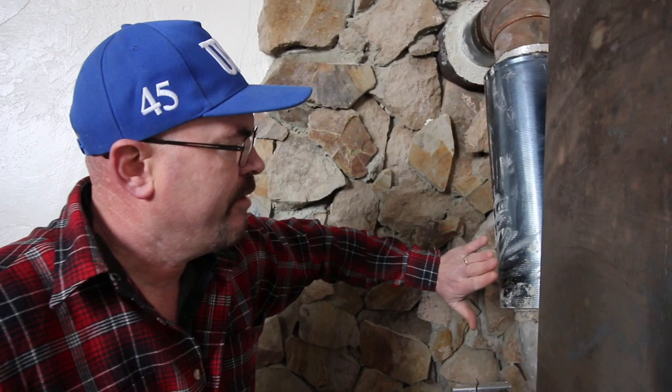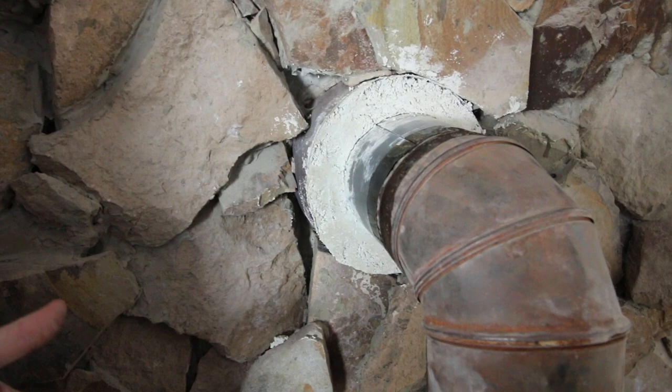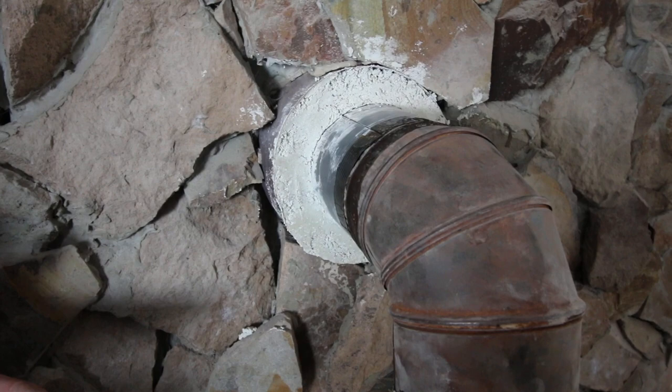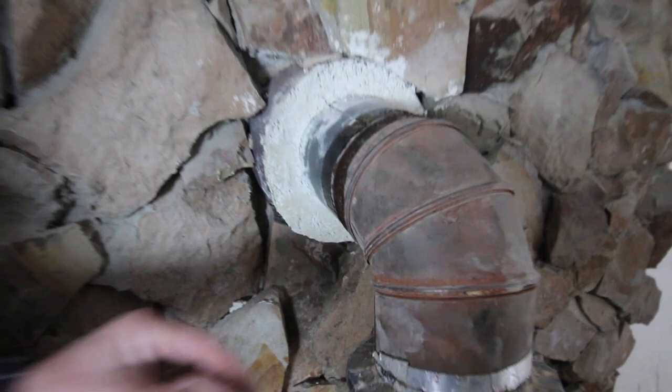This is where I augmented the chimney — we put a liner in it, a really inexpensive liner. The sections took about seven of them, only about $6 a piece, so that's $42. Then about a $6 bag of perlite poured down around it. It went in super fast — I did it in about an hour, in the dead of night, dark and cold.